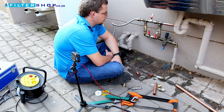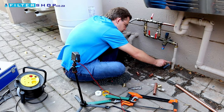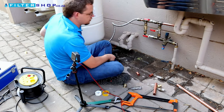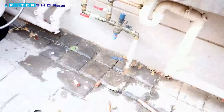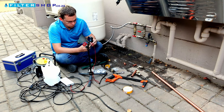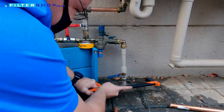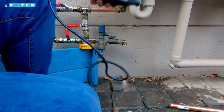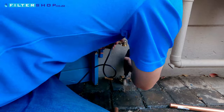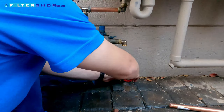At this point we thought we were basically done. Leak testing mostly looked good with one or two small leaks — and then we had a surprise. The main water valve actually cracked, which is a risk when doing something like this. As you can see it was spraying water even with the valve closed, and it had cracked on the main municipal side rather than the side we were working on. This meant we needed to shut off the main municipal supply to the property, get a new main valve, cut into the line again, clean it again with the dremel, and replace it. This unfortunately completely threw our timelines out — and that is the risk with DIY projects, as it can take a lot longer than expected when things go wrong.